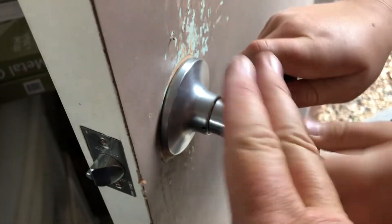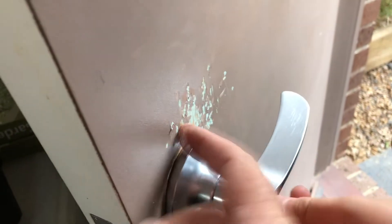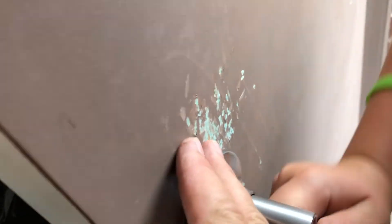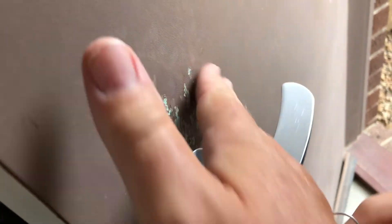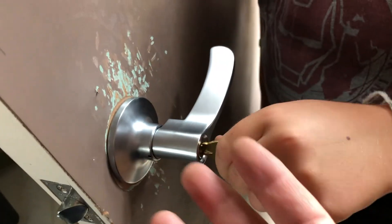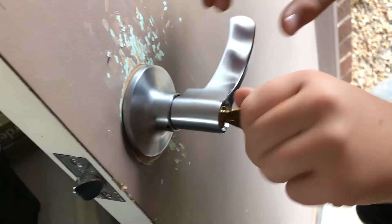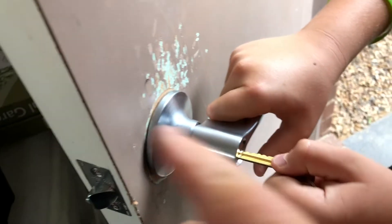I will put some links in the description for all the tools we've used — including drills, screwdrivers, and also some quality locks as well as standard locks. For the door repair: the damage is quite a lot with some deep scratches. We're going to give it a sand to start off with, get it as smooth as we can, then spray it with some spray putty — it's an automotive product — let it dry, and then sand again to get it all flat. Then we're going to take the opportunity to repaint the entire door, door frame, and the whole lot. We'll show you that in another video.